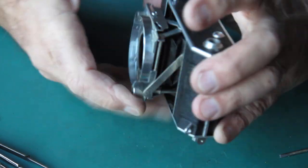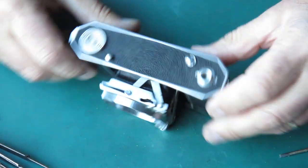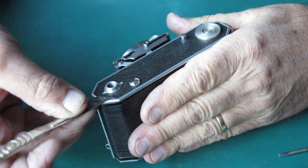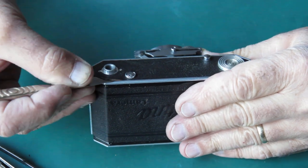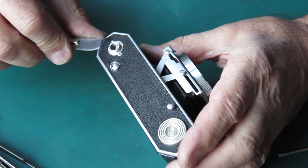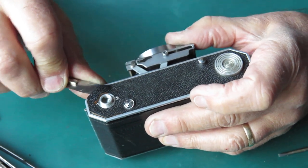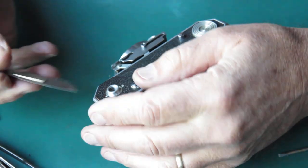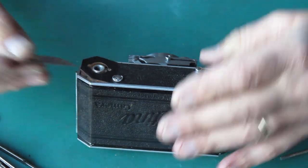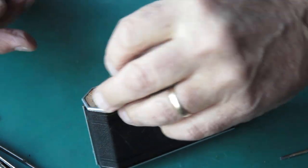Back to the base of the camera — that front's not extending very well. I want the leather off because I want to be able to get in and dismantle all of the film advance mechanism and get to the screws that hold the struts in place. Because the camera obviously had problems with loose screws, it's important that all the screws in the camera get attended to — where they're loose in one spot, they're just as likely to be loose somewhere else. If I don't go through and sort that out, it'll come back and bite me.